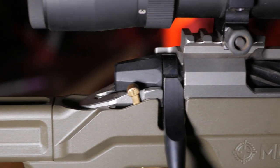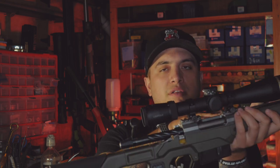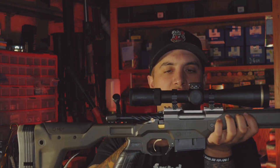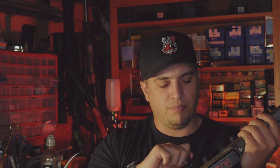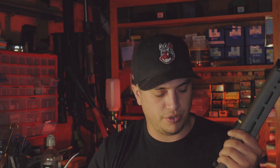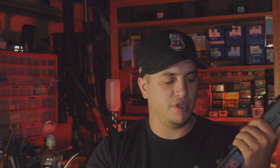We've got a Fusion TI by Lone Peak Arms — it's a titanium action, lightweight, with an integral recoil lug and integral rail. As it's a hunting action, you only have two rail sections, not going straight through. It's got a nice fluted bolt, it's a 700-platform, recessed bolt nose, and 90-degree bolt throw. It's nice and smooth but very deliberate — not silky smooth like some match actions. It's a custom 700 clone: lightweight, titanium, strong.